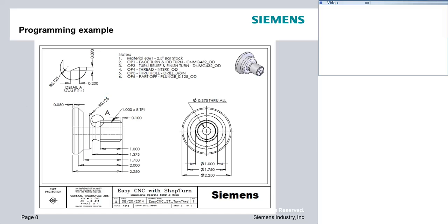This is the example we're going to use for our programming section — a simple turning example. We're going to face off the part, create a contour as you see, put in a relief, machine a 1-inch 8 thread, drill a hole through the center so you'll see how the drilling cycles work, and then part the part off using our part-off cycle. When we're all done, we should have a complete part. I'll keep bouncing back to a PDF to refer you to the dimensional data as we add different features.